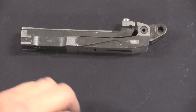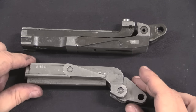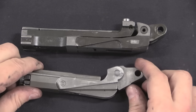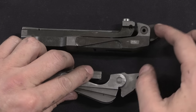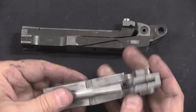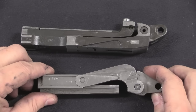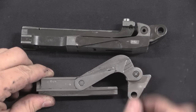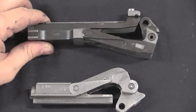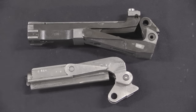Now I told you I would compare the FN Mag bolt to the FN D bolt. This is essentially the original BAR, and you can see they are essentially the same gun — we've got our two-position pivot here. On the FN D, this is the locking surface; the magazine is on the bottom, so when it locks it pivots up into the locking shoulder in the top of the receiver. The FN Mag simply reverses that and pivots down into a locking shoulder on the bottom of the receiver. But fundamentally these are the same operating principle. In essence, the FN Mag is the ghost of John Moses Browning coming back to make what is still today the world's most popular Western general purpose machine gun.